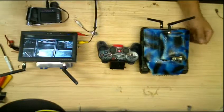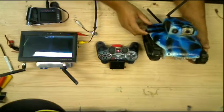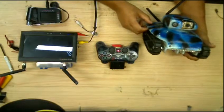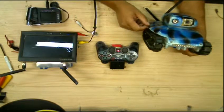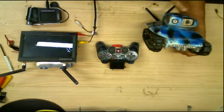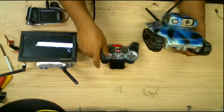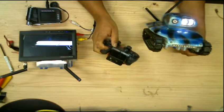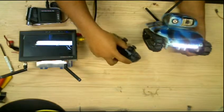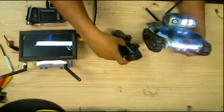As you can see, the video quality is worlds better than it was before. That has a lot to do with the type of camera used — it's a much smaller module. With the addition of LED lights, I had an array of six LEDs with the previous camera, but with this module I can do an array of ten. There's also the light bar up front and regular running lights, all controlled by my remote. I can turn these lights on individually based on whatever button I press, or have them all running at any given time.